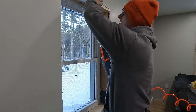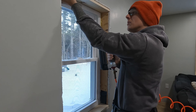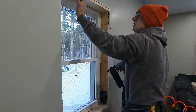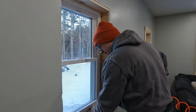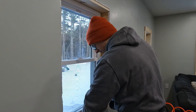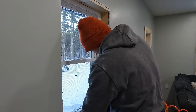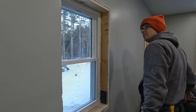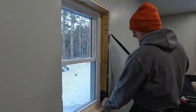I'm just using an 18 gauge nail gun or staple gun. That's why you see me angling it, because if you don't angle it, it'll leave a mark from the pneumatic thing trying to shoot out the staple that's not there. So try to get that to not happen — it's just more work to fill it after the fact. Now you're going to want to try to put your cut edge on the inside because we're painting these windows, so we're going to caulk the edge against the window. It'll give us a nice clean line on the outside and look nice and clean when it's caulked against the window.